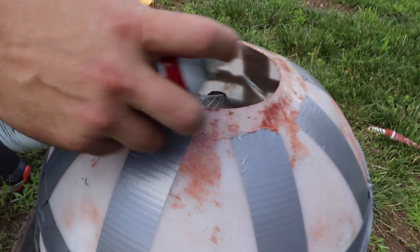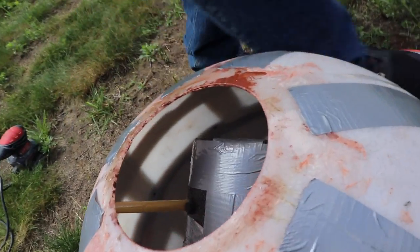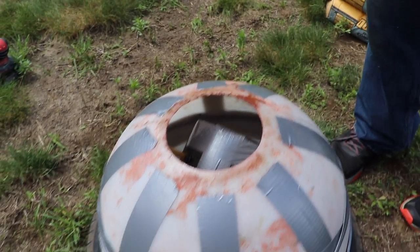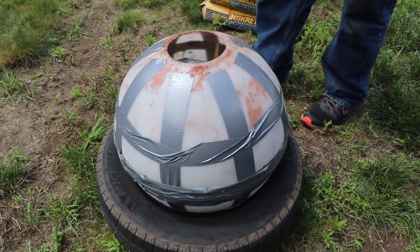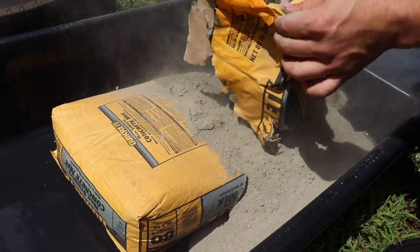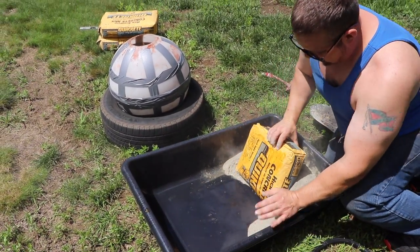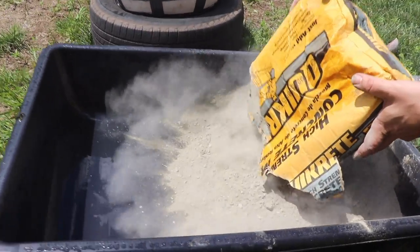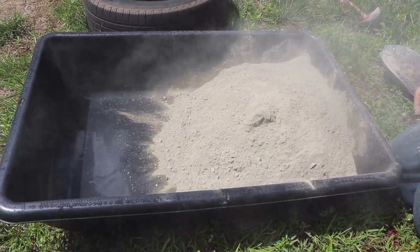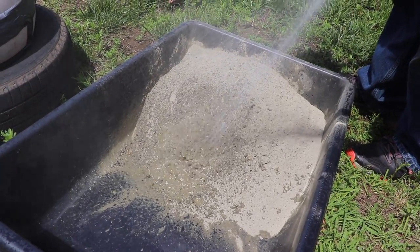We should have siliconed it before, but I'm doing it now. And the silicone prevents the stickage. Yeah, it prevents the mold from sticking. Makes the concrete come out smooth. It's okay if it pulls in the bottom. It's important to keep your mold clean too, that way when you go to do your next stone. It's a two-man job here.